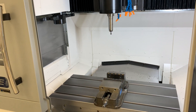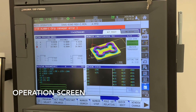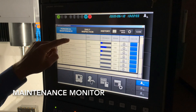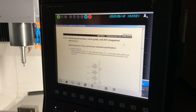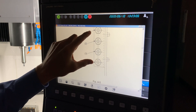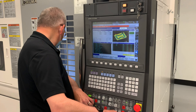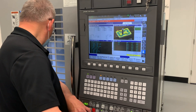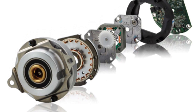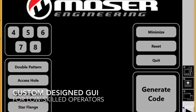Making you and your operators more productive. In keeping with the approach to single-sourced machine components, the latest generation of Okuma's control is designed to deliver ergonomics and improved operator productivity. Notable standard features include a processing speed of 0.3 ms per block and 4GB of part program storage. The use of absolute position encoders means that when the machine loses power or is turned off, it doesn't need to be sent to a home position — it always knows where it is.